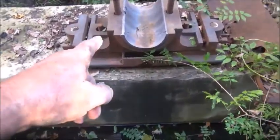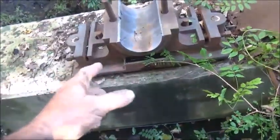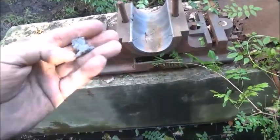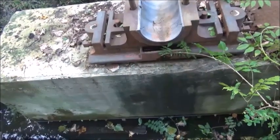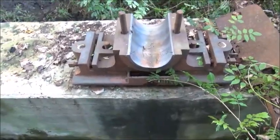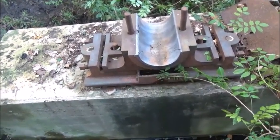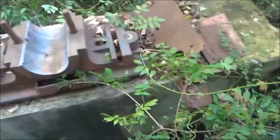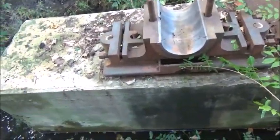This is babbitt - this is not an insert that you would buy and put in. You would actually have the crankshaft in there, dam both sides up, and actually pour the babbitt in. Babbitt is a lead-tin material that's harder than lead but softer than tin. It can be reused, and that is why any little piece of it I find I save - it can be remelted and reused. I want to apologize for not making that more clear when I was doing this.